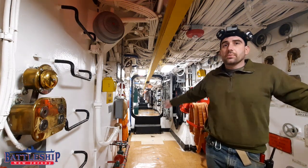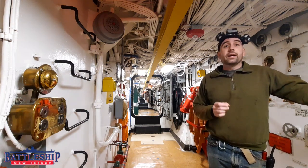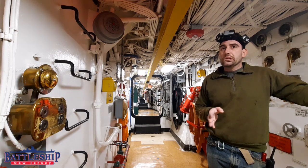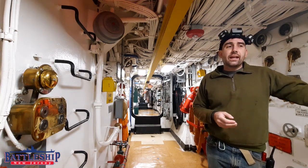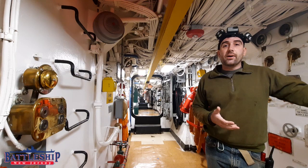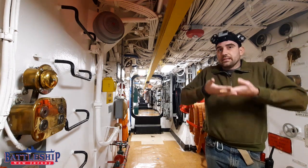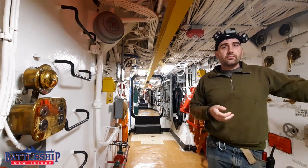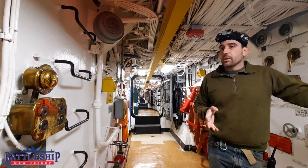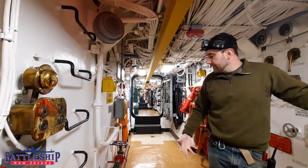Broadway here, which is approximately 200 feet long, a little over that, is covered by a splinter deck, which is made out of 25-pound STS steel. That's about 0.62 inches, about 2/3 of an inch thick, and it is much less rigid, much more flexible than the thick armor deck above it. So rather than let the splinters punch through or break pieces off the back, it is designed to bend when it's impacted and deform and take all the energy from those splinters. So that's what I'm going to be crawling around between that 6-inch armor deck and the splinter deck below it. There's just a couple of feet there before you get down here to third deck.